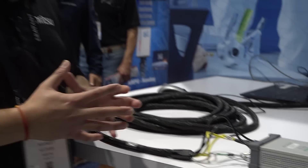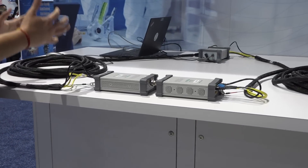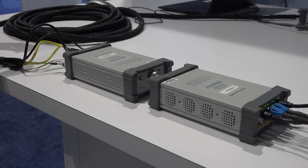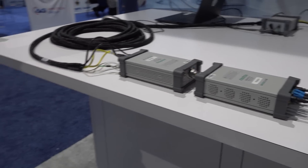In traditional VNAs, you had two ports of the VNA in the same box, in the same chassis, so that synchronization between the two ports could happen. However, for testing larger cables, large aircraft, or ships — long distance measurements, especially for antenna customers — they had to use a high dynamic range VNA and then use external coaxial cables going to one antenna and another far off, maybe 30 meters away. If those cables wiggled even a little, the phase would become really problematic, which created a lot of problems.